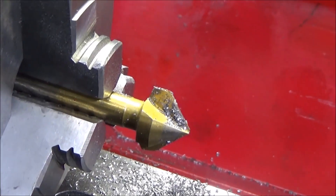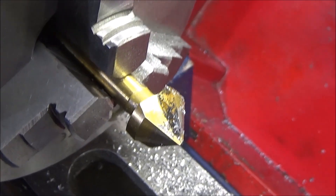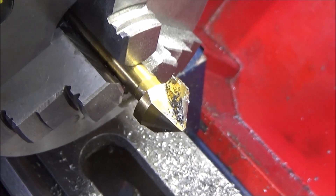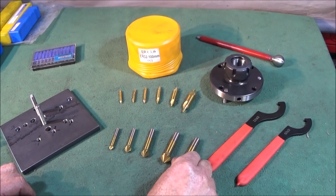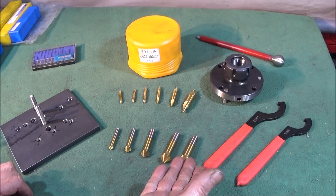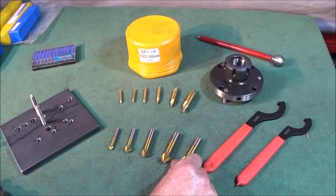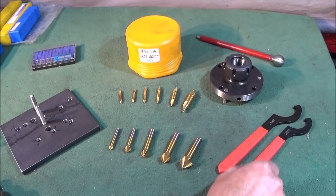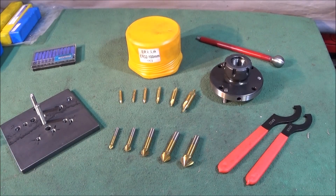In this video you saw me using this one here as a milling cutter for the V on the Chinese mini lathe carriage. It comes from this set here — a five-piece countersink set in HSS, very good tools which I got from Banggood recently. They're great for milling V grooves like I've just shown on the mini lathe and they're the exact angle for that actual V groove.